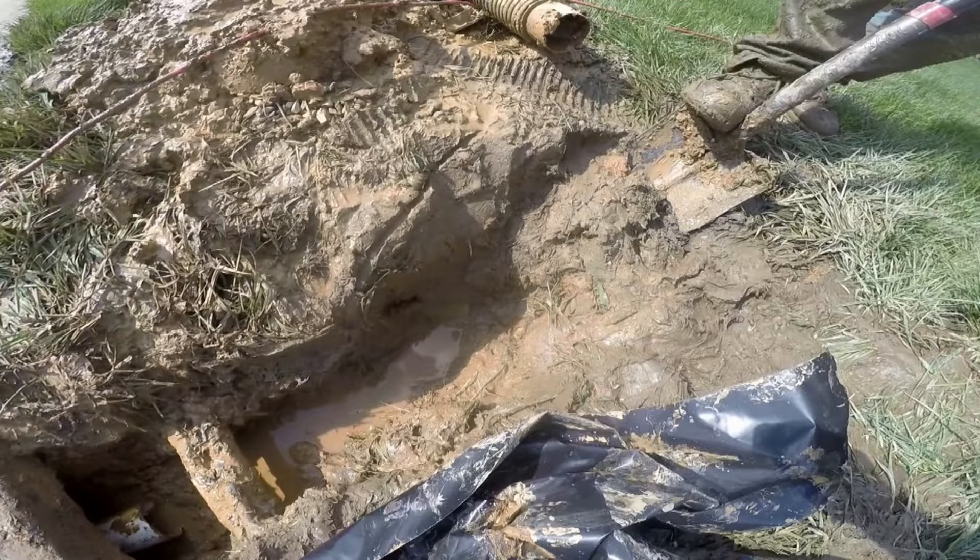Granted, this line is also gravel perforated pipe — a French drain — and therefore the water just lays in the line and leaches back out through the holes in the pipe. It's working backwards. The problem is that we need to go through that sidewalk and out to the curb. Ideally, we like to cut the walk and place the pipe under there, and we like to core through the curb. But in this subdivision, they won't allow that, so you have to use a pop-up. The pop-up needs to be placed at the curb for proper drainage. So let's take a look at what needs to be done to tunnel the sidewalk.